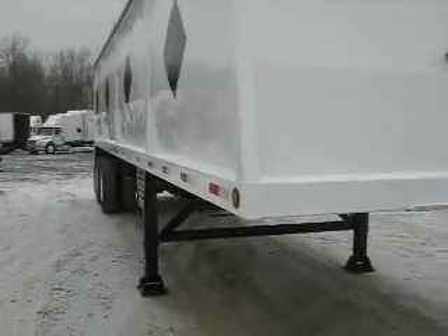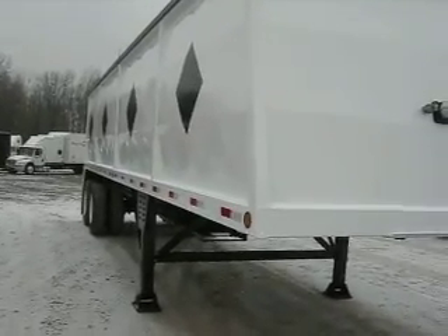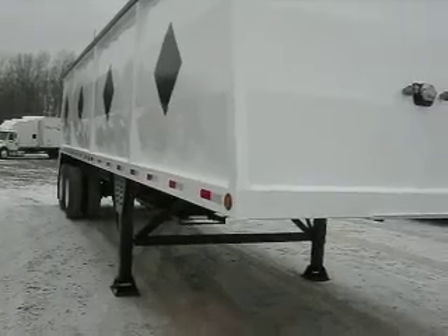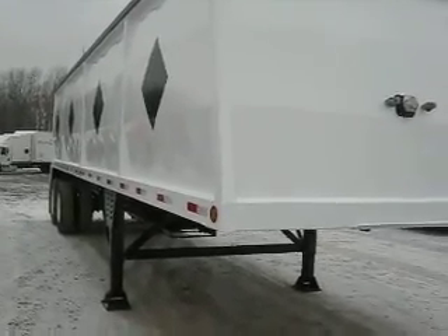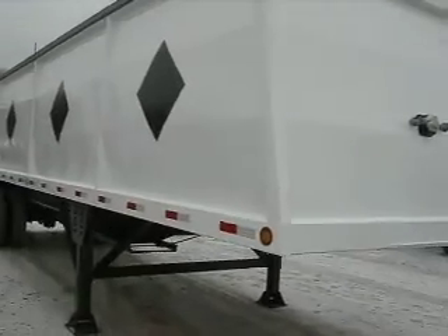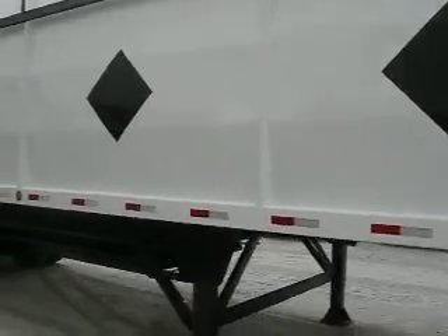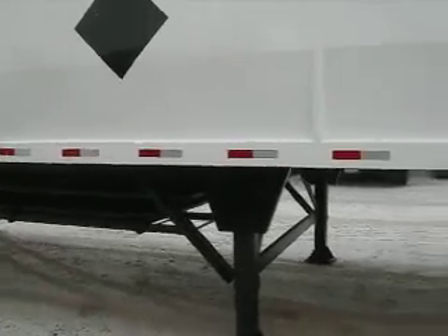Let's take a look down along the passenger sidewall of the trailer. As you look down here, you can see we've built a lot of features into the trailer. One of the main features is that every panel is cut, butted up, and solid-welded. There is no material on this trailer overlapping steel on steel — everything is inserted, cut up, and solid-welded. What you're looking at is 12-gauge sides and 14-gauge on the hoppers and slopes. You can see on these sidewalls they come up to the post, butt up, and are solid-welded, and they meet to the inside of the beam on the bottom so that nothing can lay on the inside of the trailer and rust out.